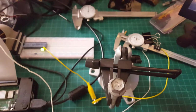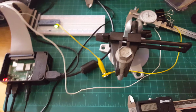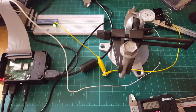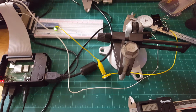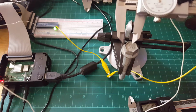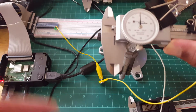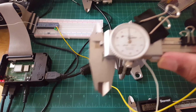So I have a way of bringing someone outside, meaning off the street, right? And I'm trying to maintain production, and I'm trying to meet the delivery date of my part to my customer. So now I have this fixture where I can actually test to make sure that, in this case, the bolt is within spec, and that person coming in, all they got to do is just take the reading, as you can see here, and they can see that it's good. And of course, over here on the monitor, it'll actually read what that value is. Okay, and it's real simple.